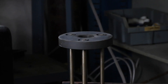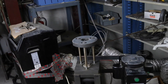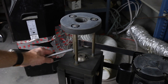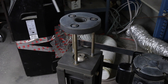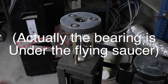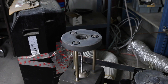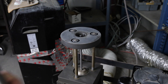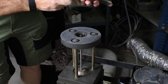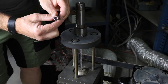I don't know if you care about the machine — you just care about the rifling — and we're going to take a close look because it's hard to know what you're looking at here. This is the actual rod that gets pushed by the giant hydraulic cylinder. This rod goes into a hole in the thrust bearing. The thrust bearing looks like a little flying saucer. Now you can see the hole goes all the way through, obviously.